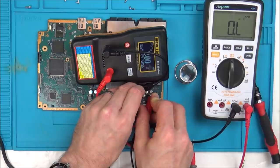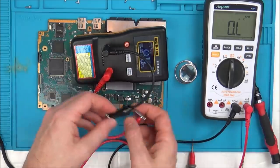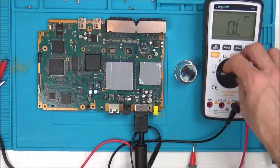Here we go. Well, look, at 25 volts at the bottom, the worst case scenario for a 220 is 0.32, and for a 10 volt is 0.6. So I suppose, what's it going to be, about 1-ish or something? And it's 1.99. I mean, I'm just making it up there. It could be way more than that, but that's 1.99. I'm wondering if that's a dodgy cap or not.